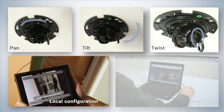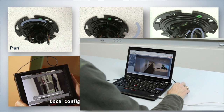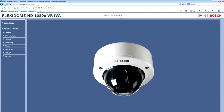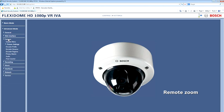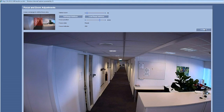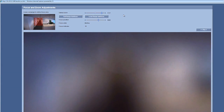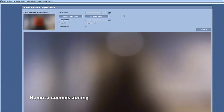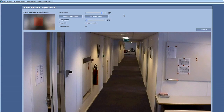The configuration menu can be initiated from the camera via the local install menu. But with its new automatic vari-focal lens, the field of view and the zoom and focus position can be adjusted remotely from any PC in your network. The new AVF lens is an important installation time saver. By remote commissioning, you can set the view and focus for multiple cameras from the comfort of the control room.